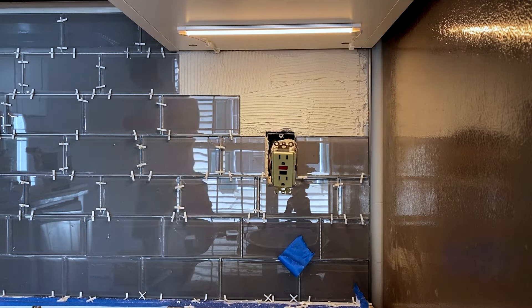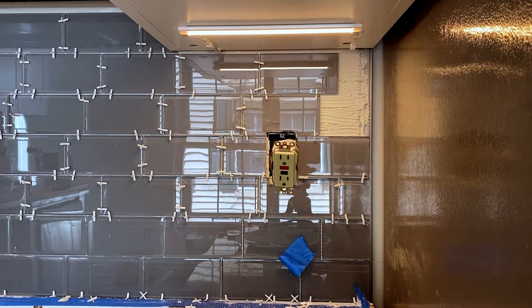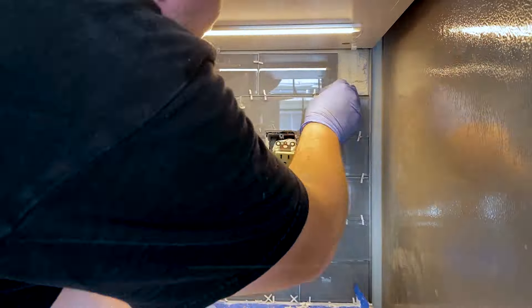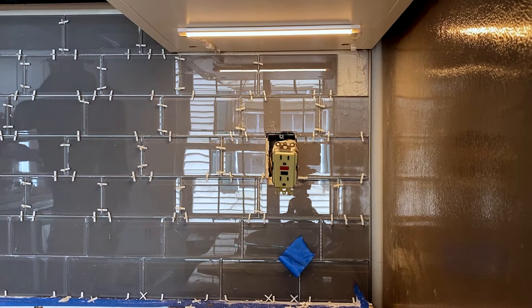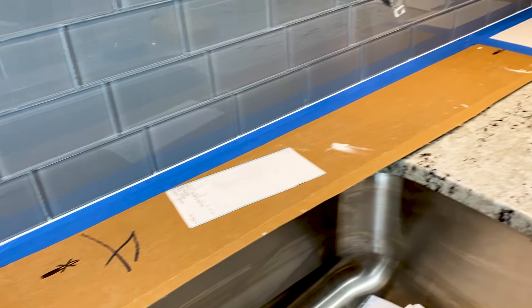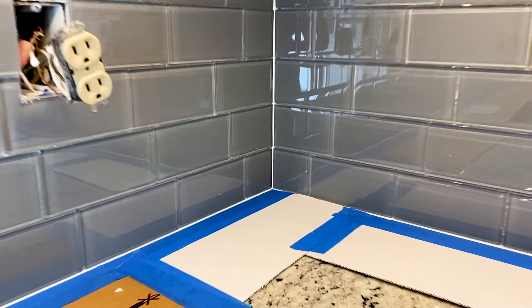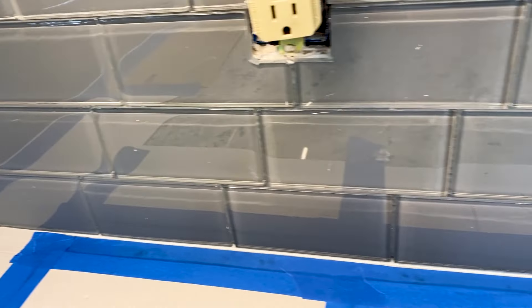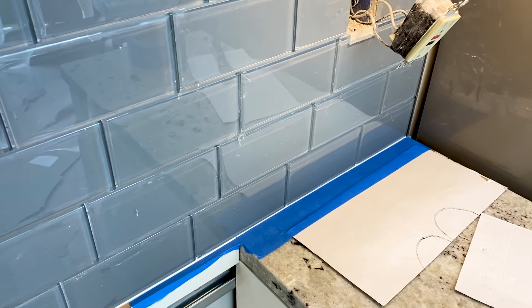I'd like to present the tip I promised at the start of the video to keep tiles from cracking after installation. Glass tiles have a higher degree of movement compared to regular porcelain or ceramic tile — they expand and contract at a greater rate, so it's critical to leave room for this movement. That's why we use color-matched silicone caulk around the perimeter and in the corners of the entire backsplash. Additionally, glass tiles often have a very delicate backing that can easily be chipped or scratched if not properly handled, so use an appropriate blade when cutting glass tiles and handle them with care.